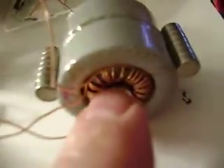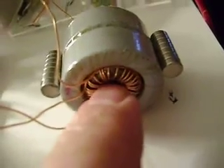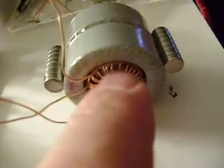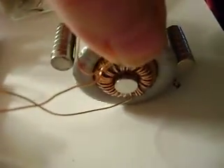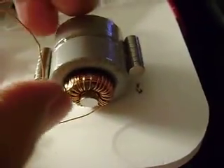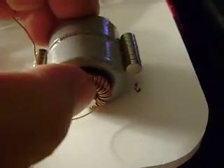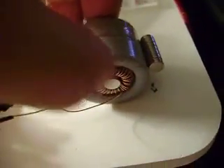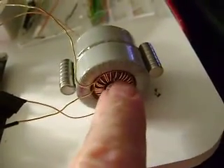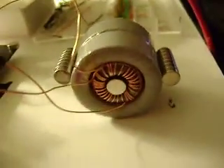This is another capacitor - that one is across the toroid winding. There are 60 turns, two layers of this same wire. It's like 22 gauge from Radio Shack. Underneath this one - here, I'll pour it out a little bit so you can see the windings under there. I didn't even bother counting the wraps on the outside. My rule of thumb is to wrap it until the inside is covered, and you're going to have enough gaps on the outside because of the radius. It's working good.